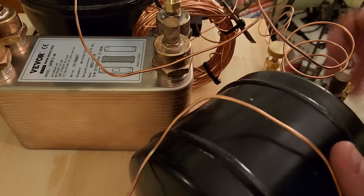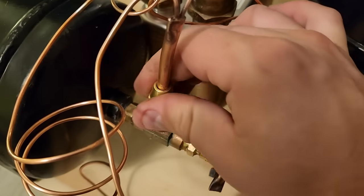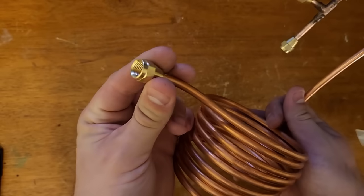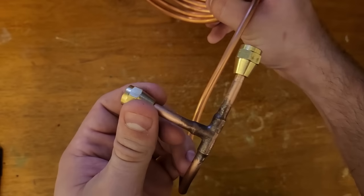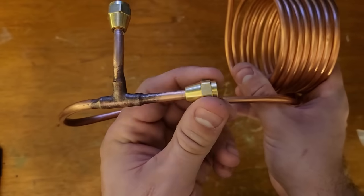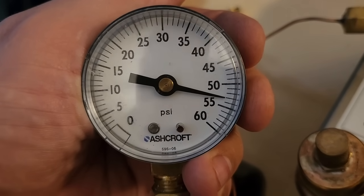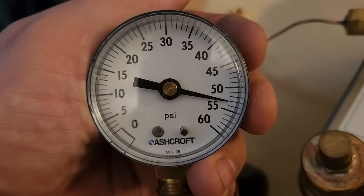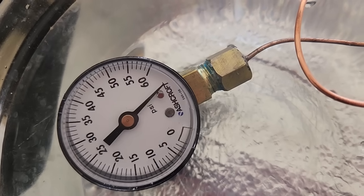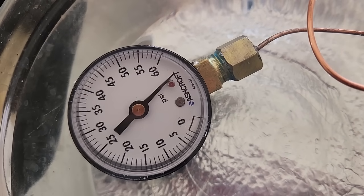Next I moved the buffer tank into position and hooked it up with more flare fittings. Here's the evaporator coil — it connects to the capillary outlet on one end and has a T to connect to the buffer and the compressor inlet on the other end. I had a minor hiccup with leaks though, and after starting out with a static charge around 55 psi, a few hours later I was down to less than 40. Putting my gauge underwater for a pressure test revealed that there was a slow leak through the fittings that I needed to correct.